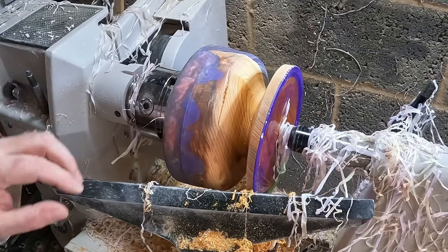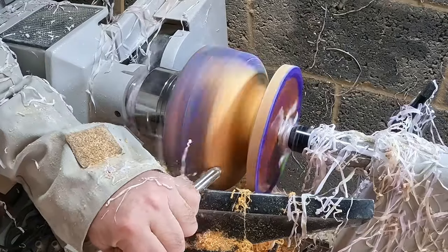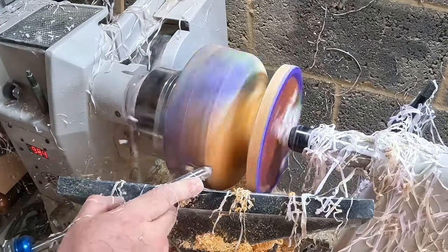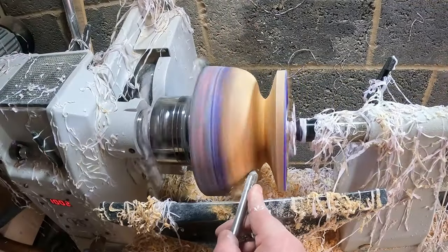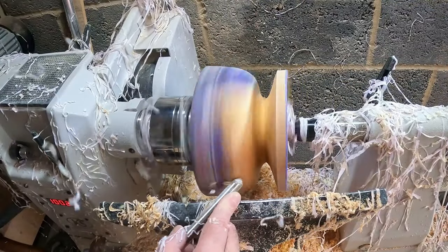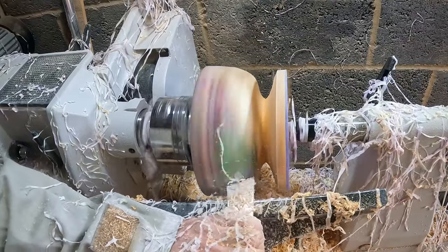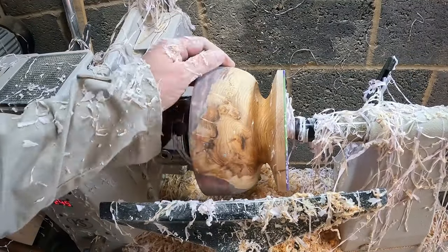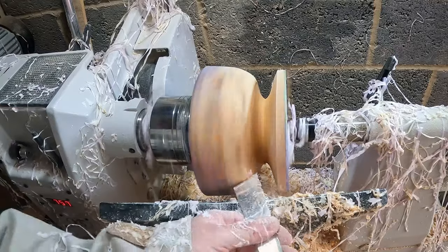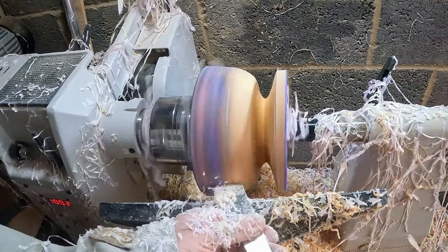It was a deep gouge, but this was a bit easier to get to, so I set to with a bowl gouge shear scraping the surface until the unsightly gash had been removed. I then used a skew chisel to blend it all back together again. With that sorted, the bowl just needed a bit more fine tuning to finalise the shape.